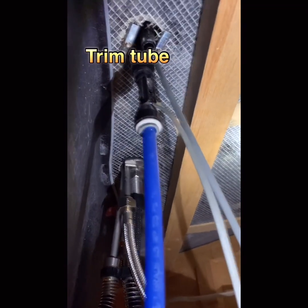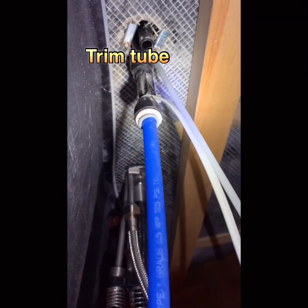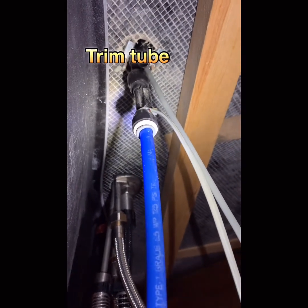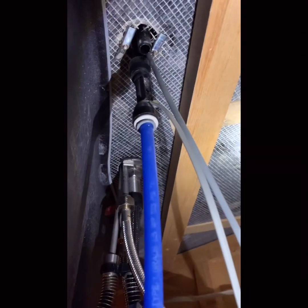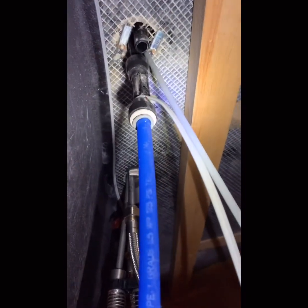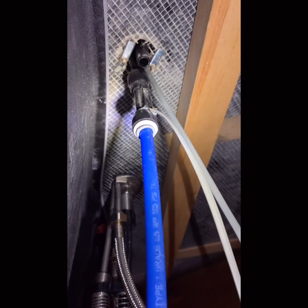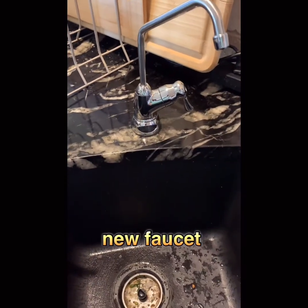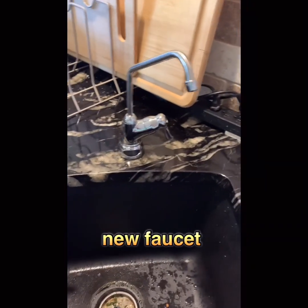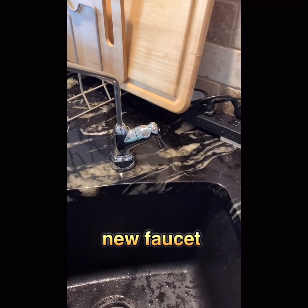After I replaced and trimmed the tubing, I could still see there's still a drop of water. So probably we need to change the faucet — the snap-in O-ring is not good. After last night I checked, there's still some drop on my tubing. I think it's time to change the whole faucet. Actually this is a brand new one — I can teach you how to replace it.